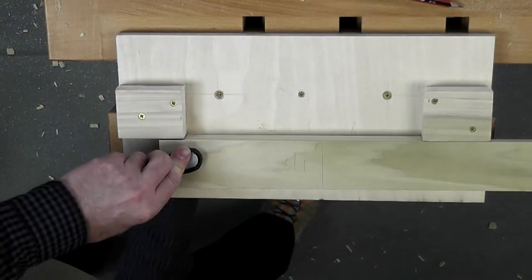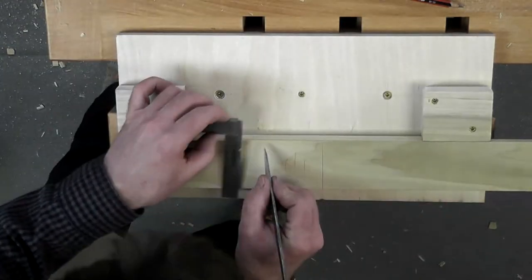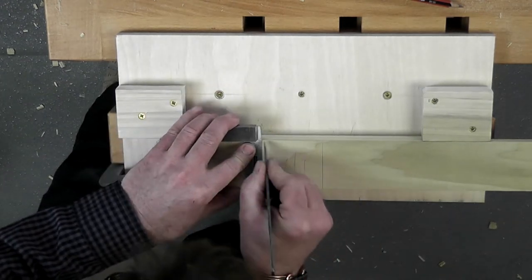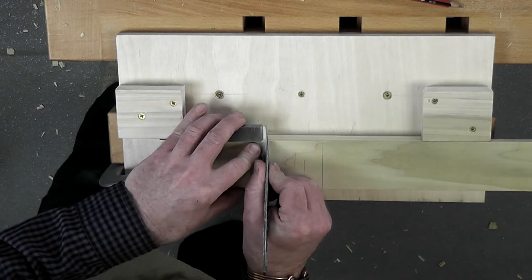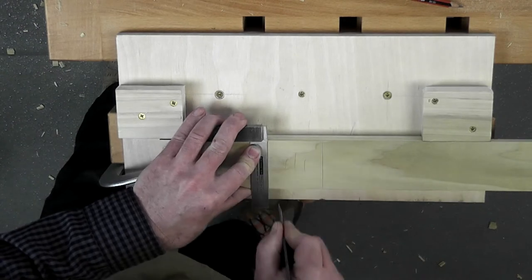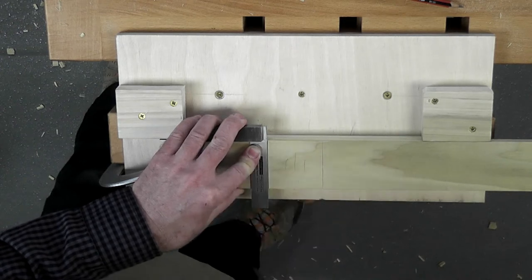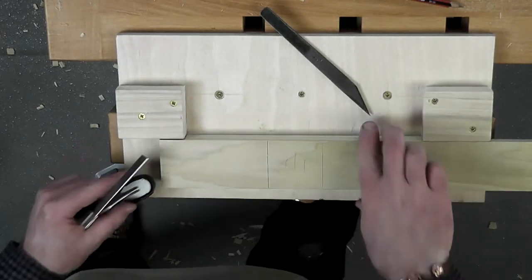What do we want to cut out? I'm going to go deeper with a knife line. So I'm coming up to position, slide in, so I can get the knife so it just drops into the groove. We could check it central. I can use the tip on the edges better. Want to deepen those. Make sure I get the square shoulder on the back. Do the other one. I'll turn it round again.